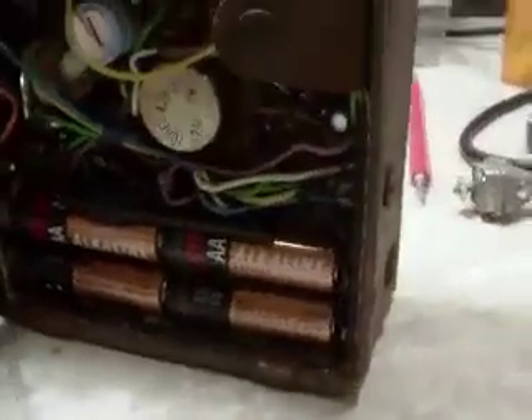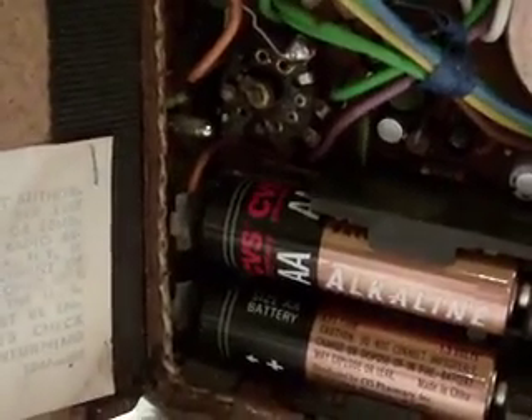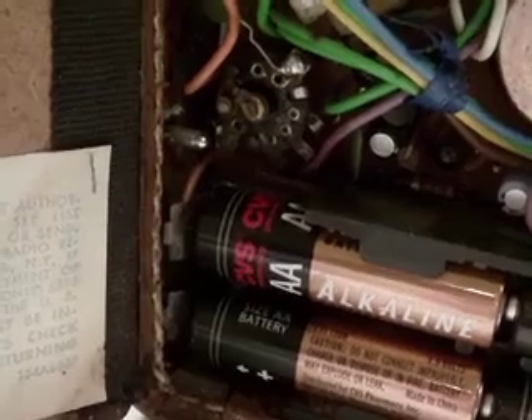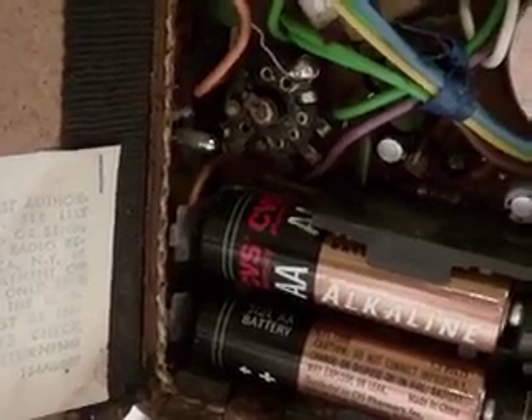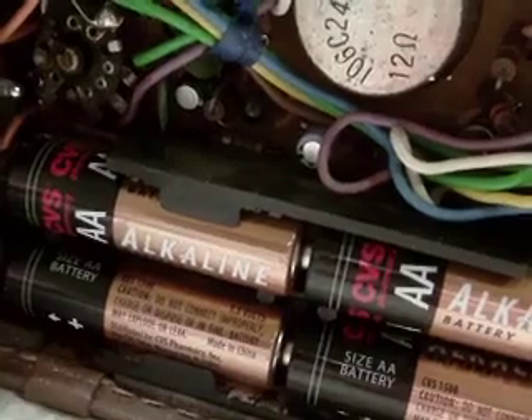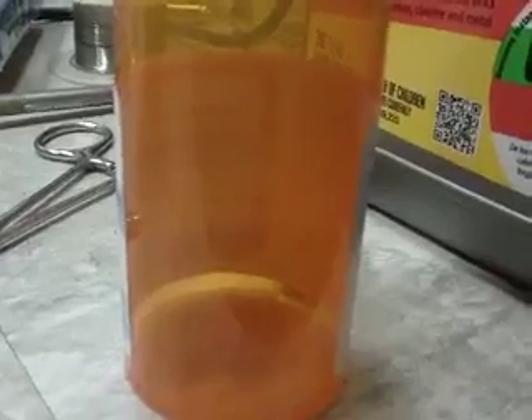Once that's done, I'll probably put it all back together and give another demonstration of it. The battery contacts I cleaned using an abrasive wheel on the Dremel tool, just to make it where they would work. The CLR had mixed results — it really wasn't that great. What I think I'm going to do is take that board with the contacts on it, which will unscrew, unsolder the wires from it, and put some CLR in there — let it soak just overnight. I don't think it will hurt the plastic at all, but see if that doesn't do better.